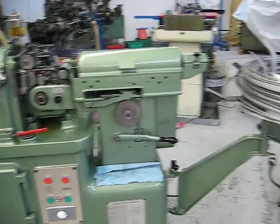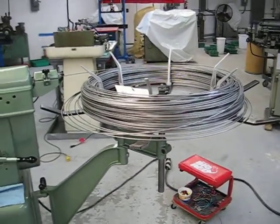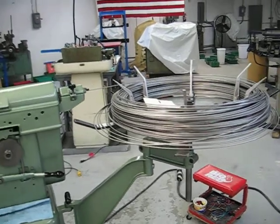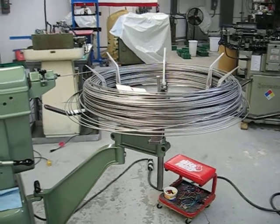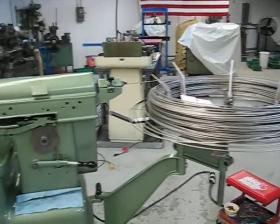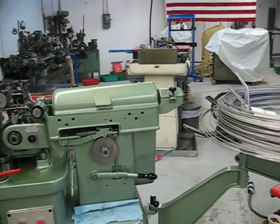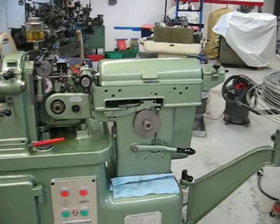This is also nice when your material only has four, five, or a dozen coils left. You hate to throw on a full roll and end up with a pile of partial rolls beside the machine. This way, just let it run — when it runs out of stock it'll come around to zero and shut down. You don't have wasted material and you're not going to have inadvertent crashes due to running out of stock.